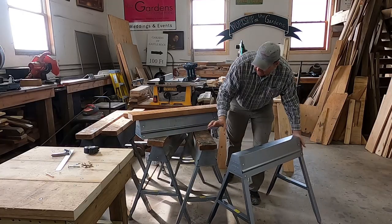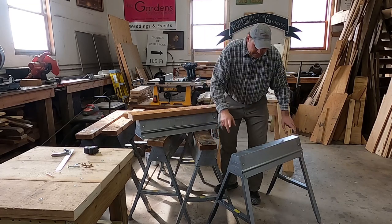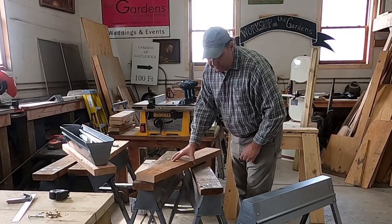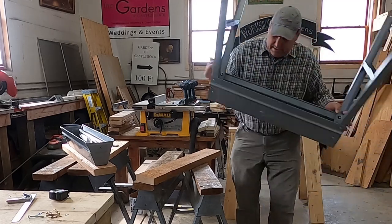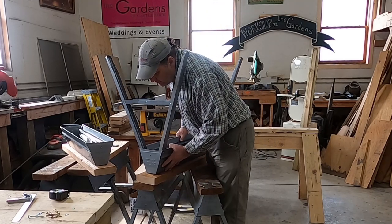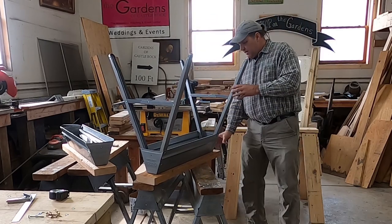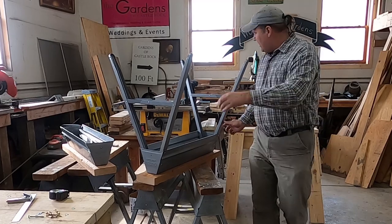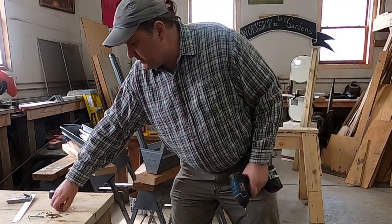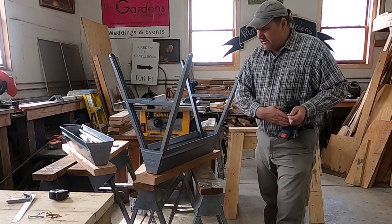But I like to add this wood on there because — like I said, carpentry — you can see on my old ones that I've already cut it all up. They do put four little holes in here so you can easily attach a piece of wood. I've already pre-measured a little bit here. These are about 30 inches and I cut a 36-inch board, so there's going to be about three inches on each side. You just kind of line it up — I measured it so it was equal side to side, but just eyeing it up will work great. You're going to want to use a construction screw with a little structural value — these are inch and three quarters, so they won't go through and come out the top.